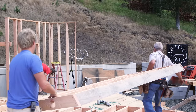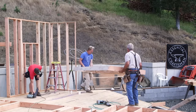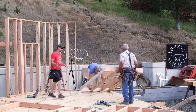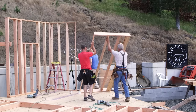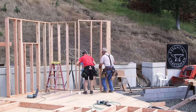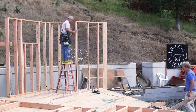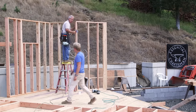As you can see, lifting walls by hand is a lot faster than using jacks. Now, most of the time, lifting by hand is the best way to do it. With interior 2x4 partitions, you know, shorties, fillers, closet walls and stuff, it is a no-brainer. You just grab the wall and stand it up and put it in its place.